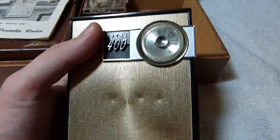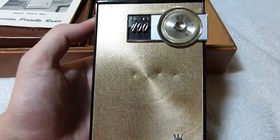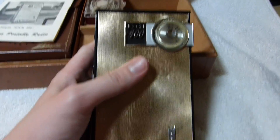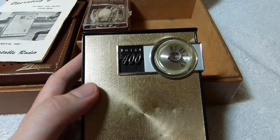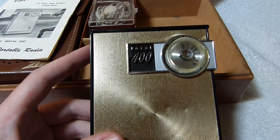This radio works great without it. I was able to pick up about 30 stations with it at night. I've only replaced one capacitor in this particular set, and it didn't even really 100% need that. What it did need was the antenna reconnected. It seems to be a very common problem on this model that the little paper mounting tab that holds the antenna to the chassis rips.